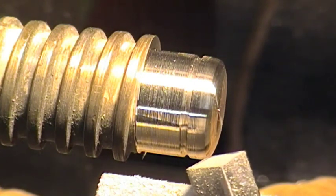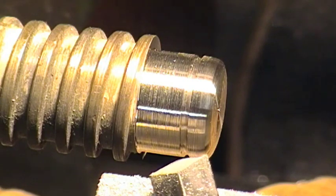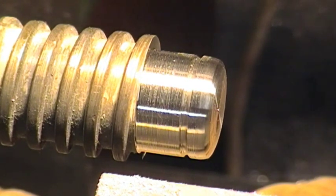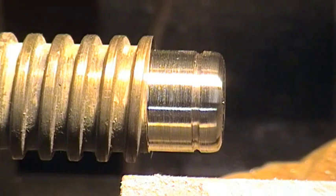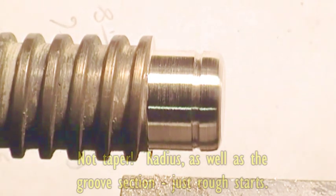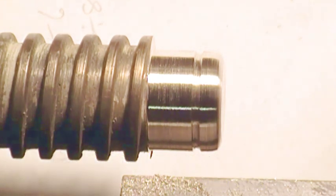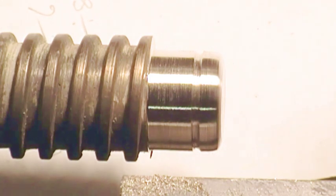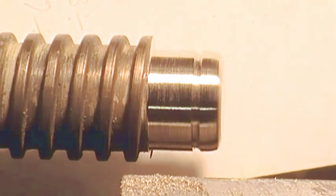On this part here we have something approximating a radius, and here we've got a groove which with a bit of work and polishing could be an O-ring groove. You can see the groove there. It's not a perfect taper — it takes longer, and the distraction of the camera makes a bit of a problem. But there we are: a slight radius and a groove — two of the things you can do with a graver. Arguably you could put in a profile tool or use other methods, but this is just one approach that can sometimes help, particularly on brass or aluminum.